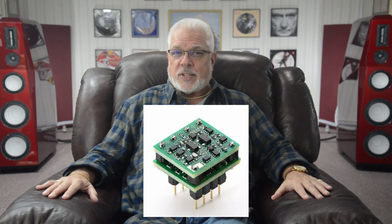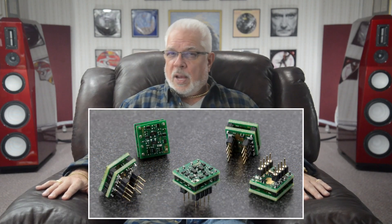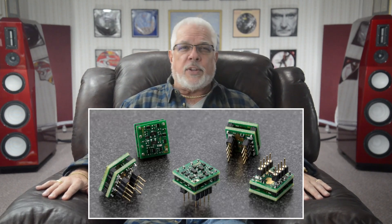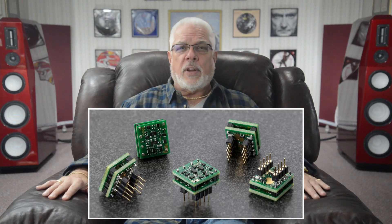What is meant by the word discrete here is that their circuits are assembled from separate devices — typically the surface mount component variety of individual inductors, capacitors, diodes, resistors, and other such electronic components. Building a discrete op-amp from individual components allows for a much more specialized maximization of the desired performance parameters of the device. The result is that they can offer notably superior performance to their integrated circuit chip-based counterparts, delivering a more detailed and engaging listening experience with improvements in lower distortion, more efficient and greater output capability, and much better imaging and soundstaging characteristics.